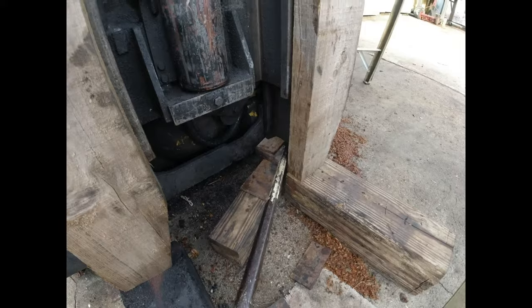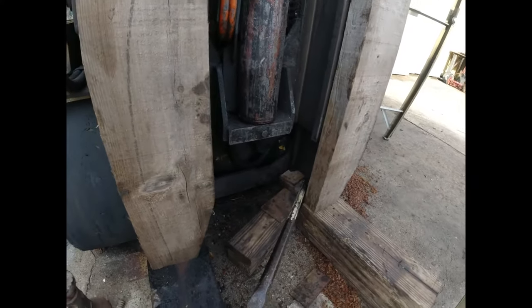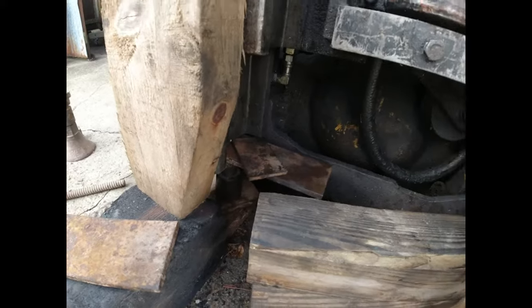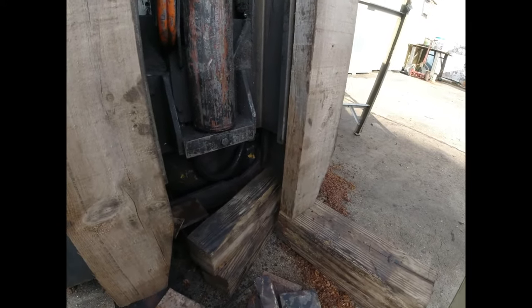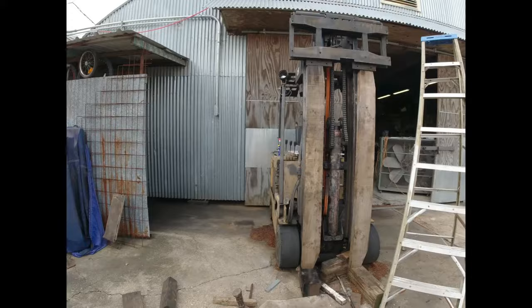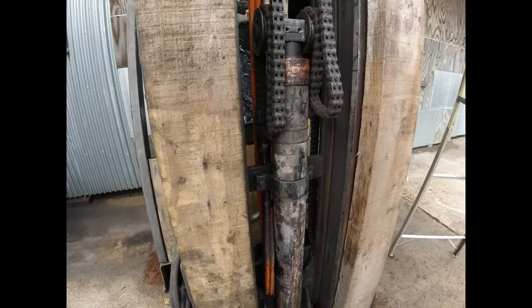It's probably not the way the owner's manual recommends this be done, but it's the way I got myself into it, so we're going to get it. I've been prying and shimming, prying and shimming, and I'm within an inch of making up the hose - I just need to come up another half inch. A little more prying, a little more shimming, making sure I've got support on both sides. I got it - the hydraulic hose is hooked up and tight, and I've got the two stoppers on the two chains back to where they were before I took it apart.